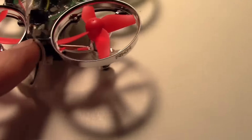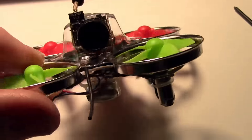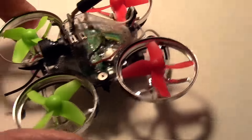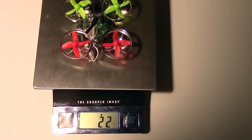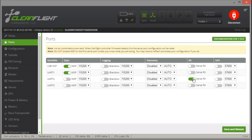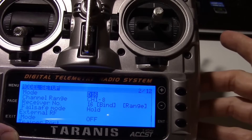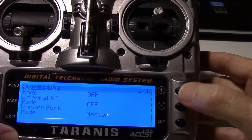I couldn't get a standoff in the back — it'd be difficult, and the Craze Pony canopy isn't made to accept one there. In the front the camera was in the way, but two on the sides felt like enough, and it's easy to remove those screws to get in and program the board. After the upgraded board, it still weighs 22 grams — very light. For part 4, we're going to finish up by showing how to configure CleanFlight for the Tiny Whoop and configure the FrSky Taranis X9D radio settings so we can fly the Tiny Whoop, and then we'll give it a short test flight. See you next time.